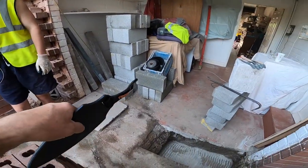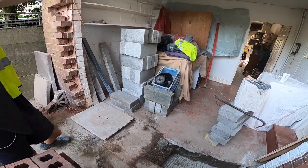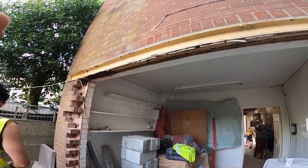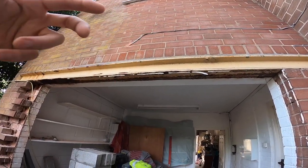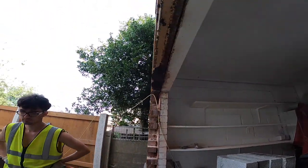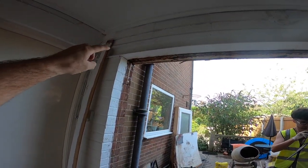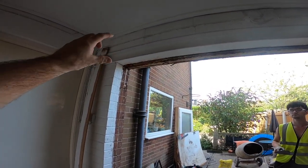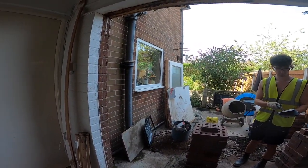So today is up to DPC, lintels across, manhole sorted out, get as much brickwork as we can today. Pick up the trestles tomorrow, acros and strong boys, prop this lot up above the brick and edge, take all that out. Two big steels, we'll have to cut them to get them in the van because they're getting weighed in, and then run across, and we're going to drop it across there. Because it had a little stud on top of the door there, so we'll put a lintel and take brickwork over the top of it, get it all nicely sealed, and we're going to attempt to fit that door back ourselves.